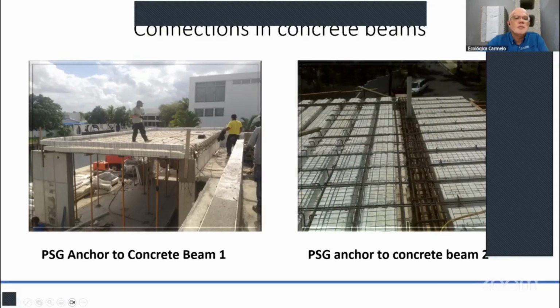Here you can see the beam that they'll be forming, and they're forming it right now. It's very important before you walk over these panels that you have your supports, say 4x4s with steel columns in there. You've got to space them out every 4 feet minimum. If the length of the panel is going this way, then your supports have to go the transverse way, going down this way. That's very important. Then on the right here, you can see the bond beam.